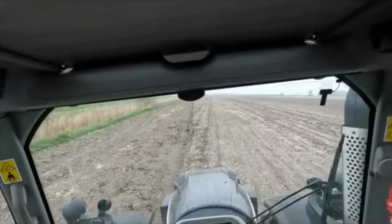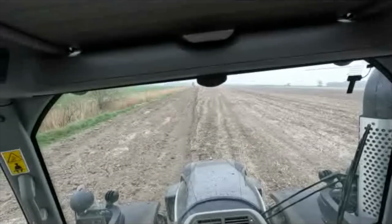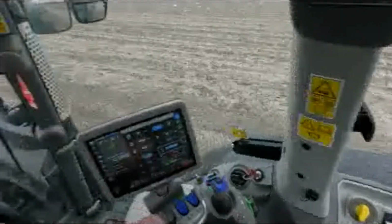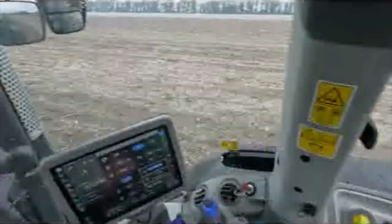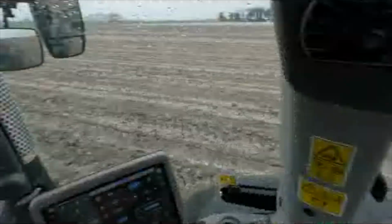So you can tell almost every time I go across the subsoiler wheelings, it pulls the plough and pulls the tractor around. So we're going to try hardest to keep out of the furrow a little bit. Every time the wheel drops in a ridge where the subsoil has been, it's nice and soft, so it just pulls around all over the place. But I think we're all right there. A couple of ends to straighten her up. No laughing at my ploughing, please, people.